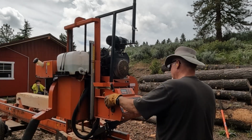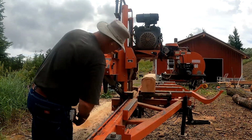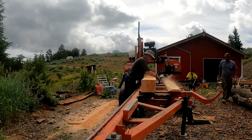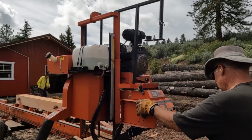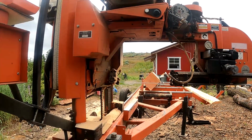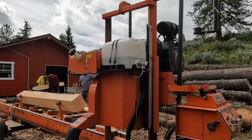Make a flitch cut, and again, we're doing primarily 2x. Occasionally you may see me take a 1-inch flitch. That's because when I'm milling to a cant, I have a specific measurement in mind. And I do a little trick so that if the brain's not working real well, I'll actually take a Sharpie and write my cant sizes right on the cover for the simple set. And believe it or not, it really helps, because sometimes you can't remember.